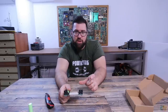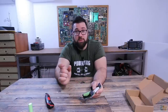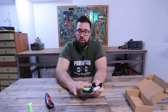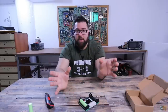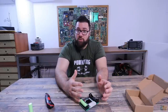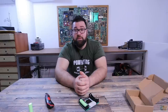You can also add a small chip to control the current input. Like that, you keep the battery safe, but you can also measure the current input and output with small modules like the ACS712. Control that with the Arduino, display the values on the screen, count the time, and then store all those values, the time and the power, inside the EEPROM memory, and output that on the screen or maybe even in a TXT file. Like that, you will have the power and the storage charge capacity of that battery. And it should be a very easy project for me to make.